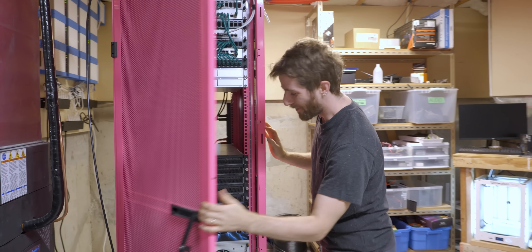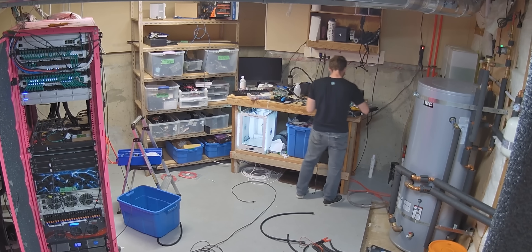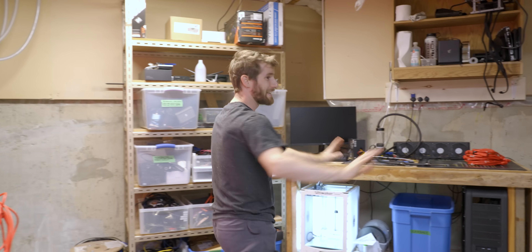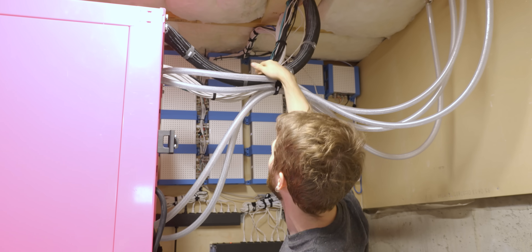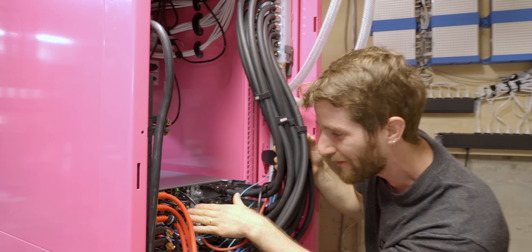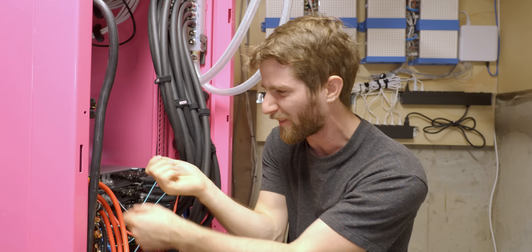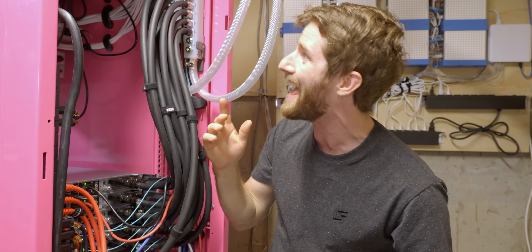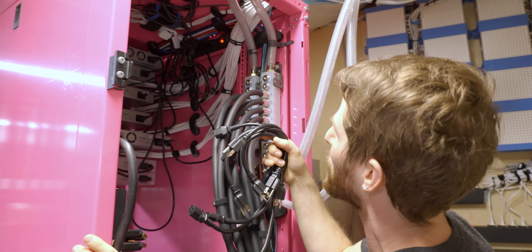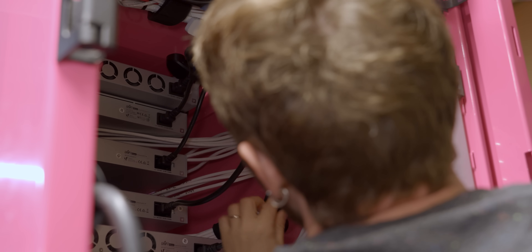It's done. Look how sick this is. There was everything from missing screws to missing GPU retention to extra standoffs under one of the motherboards, but they're all fixed now. The room is tidied, the cable management is incredible. I've got braided sleeving on this one. All the water whips are exactly the right length. I can have one of these systems disconnected and slid out on the test bench for troubleshooting or BIOS updates in about 45 seconds flat. I just got my custom-length power cables for the top, so I'm going to get rid of all these hangers.